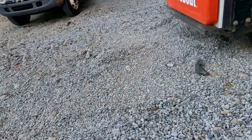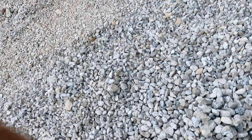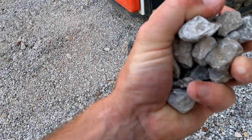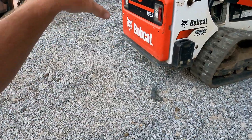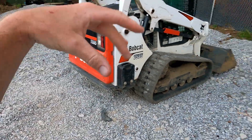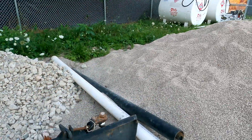Versus number 57 — ASTM standard 57, which is three-quarter clean — this is going to work better to demonstrate, because that three-quarter clean has more bearing capacity and thickness than this. This loses most of its bearing capacity after about two inches.